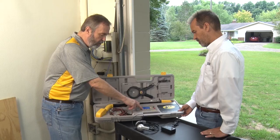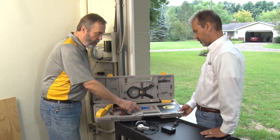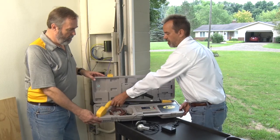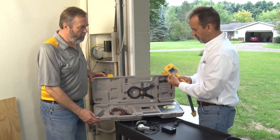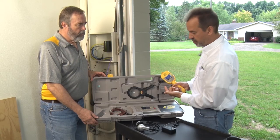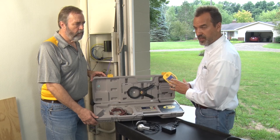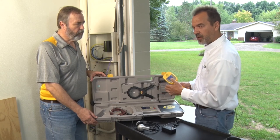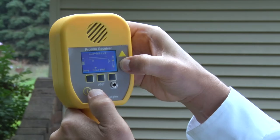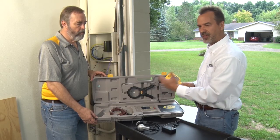When you're done with this mode and not using direct clip-on, go back to idle by selecting Done. When you're through with the unit, you can just turn it off with the power key on the wand. The wand is also digital — turn it on, and you get the same kind of digital screen with the same menu setup, but directed towards the wand. You can set it to null or peak. Over here is the volume control. One important thing: when you set up the locator on a certain frequency, like low, the wand also has to be on low — they have to match to work together.